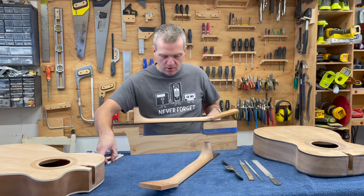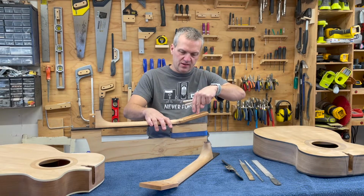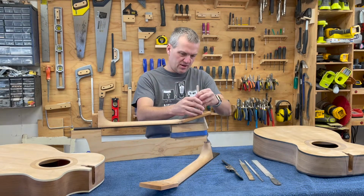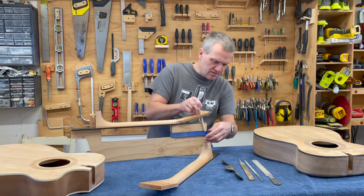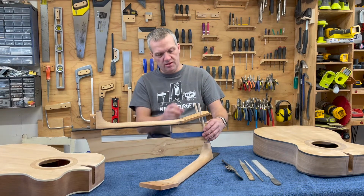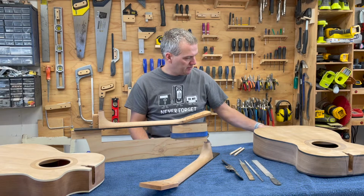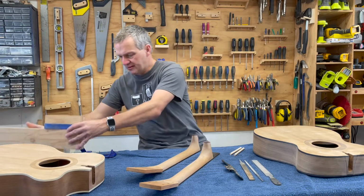And this part right here, I didn't want to apply pressure directly on it because I was afraid that it would maybe crack something. But I found a nice trick using those dowels that fit into the peg holes, and using this little strap contraption down there, as you've seen me use. It was holding pretty good. I was able to carve the whole thing and it didn't really move, and just clamp this base into my vise right here. So this was really useful, pretty simple to do, and did the trick.